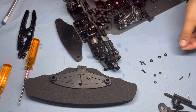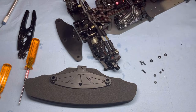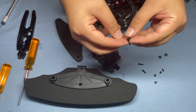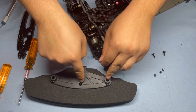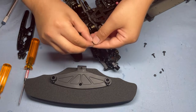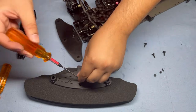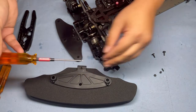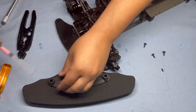We're also going to need an M3 by 8 set screw. Go ahead and put these together with the washers. The Nylock nuts actually install from the top — there is a place for them to sit, so you don't have to hold them. I'm going to install them with my two millimeter hex driver so I'm not worried about things flipping over, and that worked perfectly.